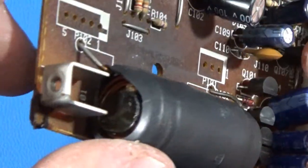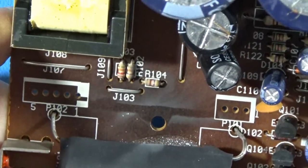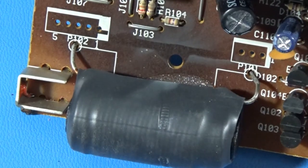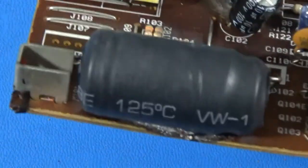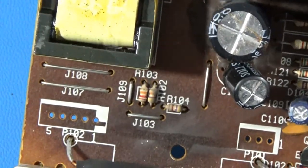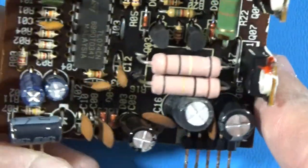It's some kind of inductor — I can see the coils in there, the copper winding. I highly doubt that would go bad. For one, it's really large. Maybe it got hot but I don't think it would have gone bad — they don't normally just go bad. We do have a schematic. It says P101 and P102 — those must be those plugs. I don't actually see a silkscreen for that. But we can check some things out on this board and see if anything else actually failed here that would have caused this blackening.